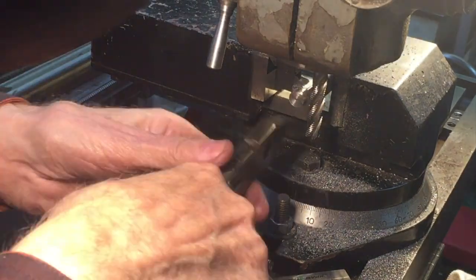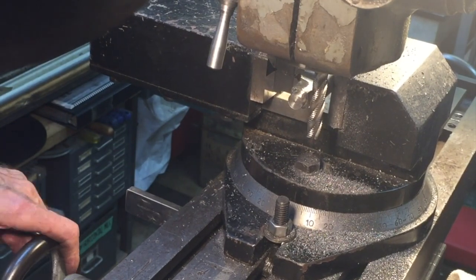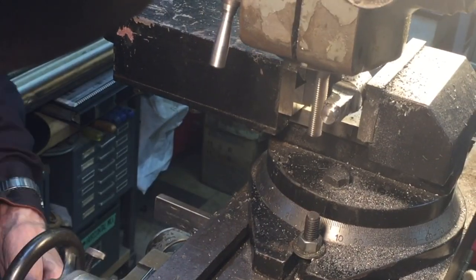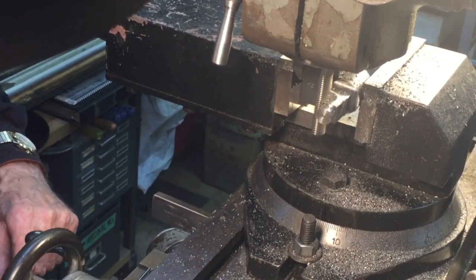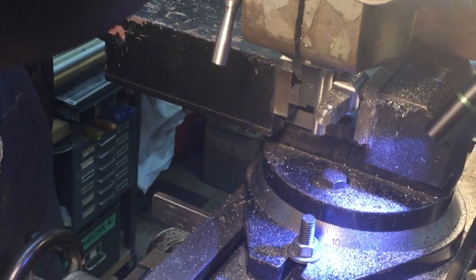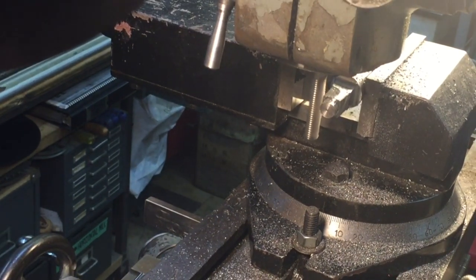It has to be adjusted because I didn't want to take off from the flat part. I only wanted to mill the flare further down with a smaller mill. The roughing mill at this point is still turning just over 1,000 RPM.